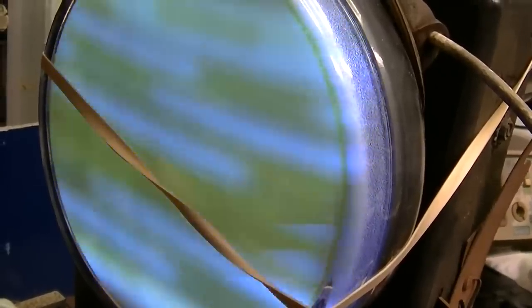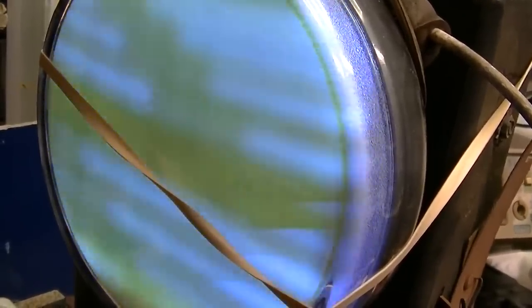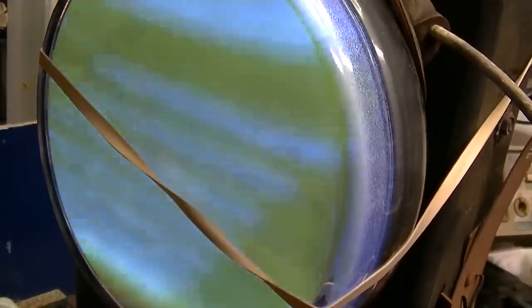But yeah, I think this thing is just so loaded. All those capacitors are just shorted. So leaky. Probably one of them shorted and pulled the IF voltage down to zero. That's why it blacked out like you saw there. Come on, stop. And there's no sync. It's probably capacitors. But hey, I think it's got a good chance of being working.